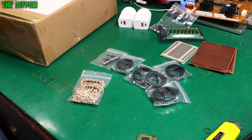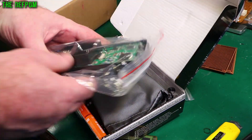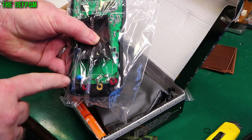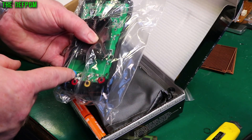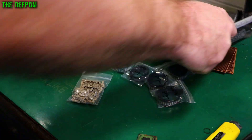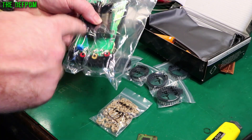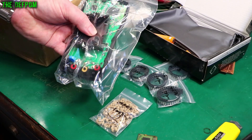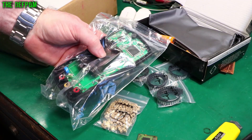I got these because I needed to fix this multimeter — which I did a review on, it's a Must Tool one. You can see it's got fuses which are soldered directly to the circuit board, not even in holders. I think that one there blew — I put too much current through it and popped the fuse. So I'm going to take that fuse out and solder on a holder instead, which is what should have been there, and pop in the new fuse. That way in the future it's exchangeable. I won't be keeping this multimeter — I've got so many, so this one will be sold.